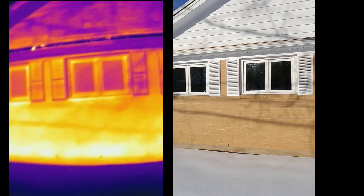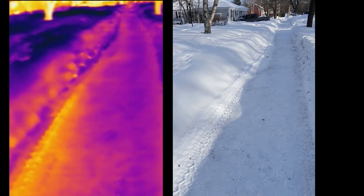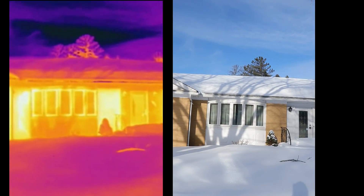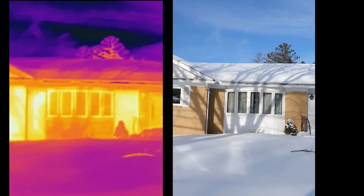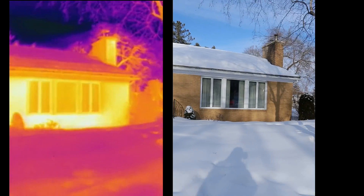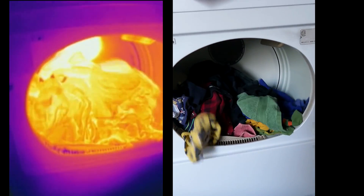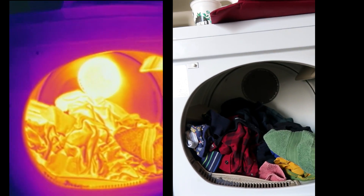The front of the house is very warm at the moment, but that's all from sunshine, not from heat leaking out. The sidewalk is warmer along this edge because that's where the sun's been shining on. Yeah, look at how warm those walls are — the brick is all warmed up from the sun, so there's more heat coming off the brick than off the windows. And I am relatively cold: my pants are warm, boots are cold, jacket is warm, face is warm and cold. It's like red hot inside, and this is where the air comes in — that's of course the hottest.